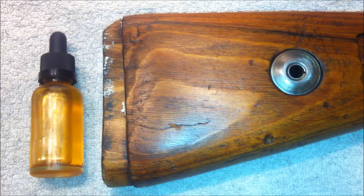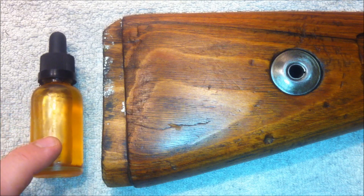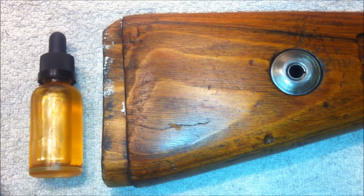After the stock was degreased, it was treated with boiled linseed oil. After its initial treatment, I try to oil the stock about once a year. Boiled linseed oil is an unusual substance and needs to be handled with care — it generates heat as it dries, so if you have any rags soaked in it, you need to take precautions to make sure that the rag does not spontaneously combust. When applying the oil to the stock, place the smallest possible drop on the wood and spread it around with your finger. Be careful not to apply too much, as it won't dry afterwards. After coating, I let the stock dry for a day or so before reassembling the rifle.